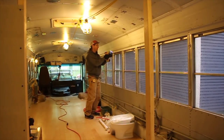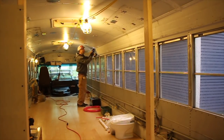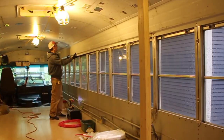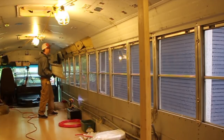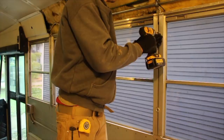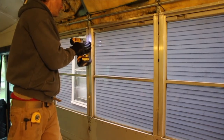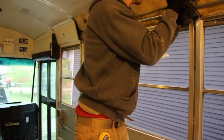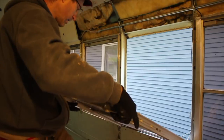All but five of the many prison bus windows have never been able to open and shut. To remove the windows on your prison bus, first remove the 12-foot-long sheet metal that's holding them in place. Then remove several screws along the sides of each window, and gently pry at the windows — then pry a little less gently — and finally they'll budge free.